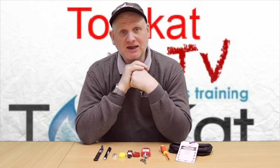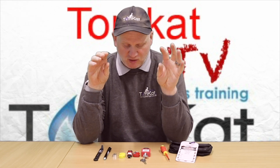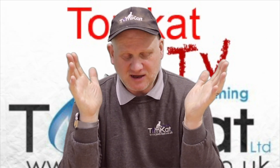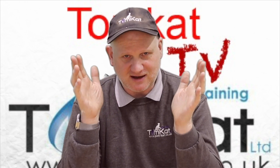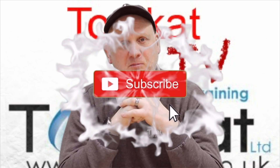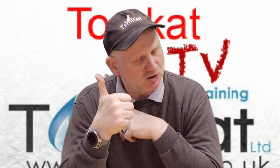So that's my little look at this locking-off kit — technically it's for electricians, but for us gas engineers it's really, really important that we do this, because it's in Technical Bulletin 118A. Hopefully you've seen it doesn't take that long to do. One thing to remember though: once you've isolated the supply and locked it off, you need to check that you have actually isolated the supply — that's the main thing. It just takes a few seconds, but doing these little things will help you go home to your family at the end of the day. Thanks for watching, guys. Catch you on the next one. Cheers.